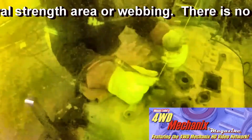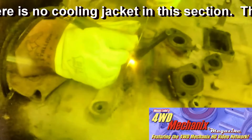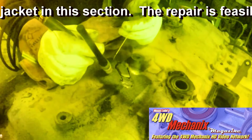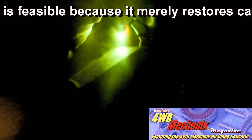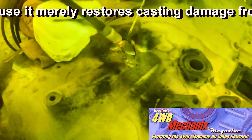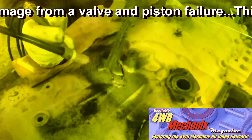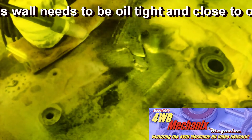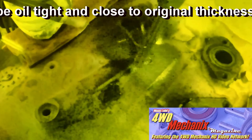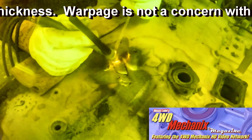The broken block piece is now being welded into place using the TIG method and Weld Mold Company filler rod, 700 and 750 type. Here D-Wade performs the weld using 062 filler rod and a 3/32 electrode. D uses an air-powered descaler as a unique way to shock-peen after each weld pass. The broken casting serves as a bridge over the hole gap.